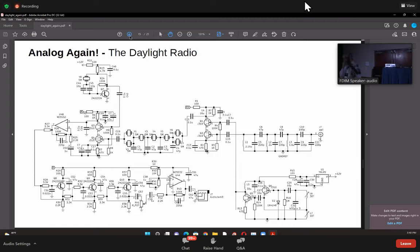In fact, in this one I have soldered pigtails onto it and used it like a regular leaded capacitor. Here you might be able to see that. Somewhere here is an SMD capacitor which is tack soldered on for coupling. Between the gate and the tank circuit, there's a 10 pF. You do not get 10 pF in polystyrene, so it's an SMD capacitor there. So this is the transmitter.